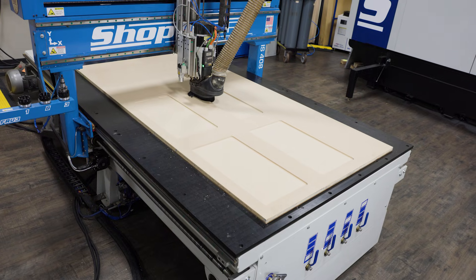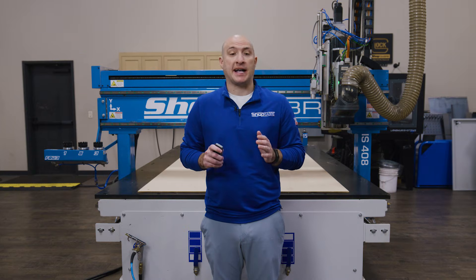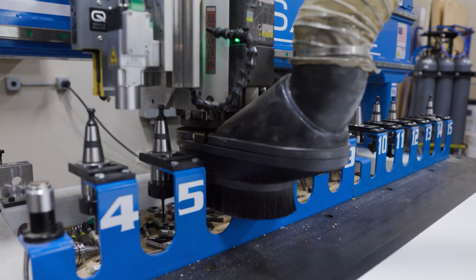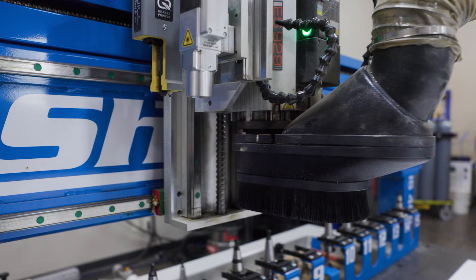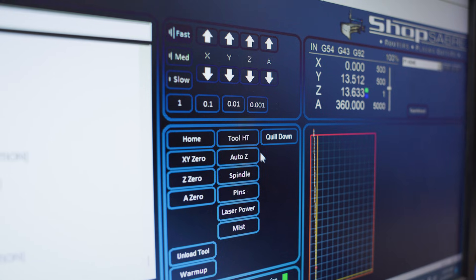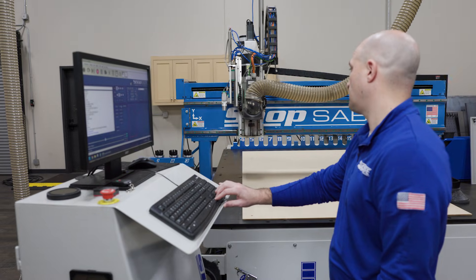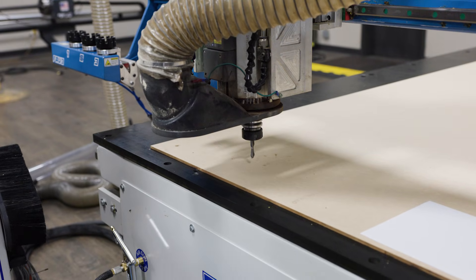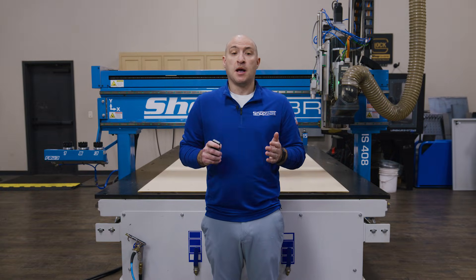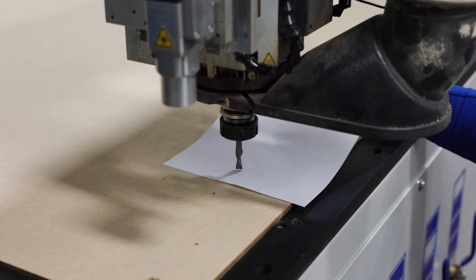Let me show you how we do that. Since MDF shows even the smallest discrepancy in height, we're going to take some extra time to set up our bits to eliminate as much sanding as possible at the end. Our IS series has an automatic tool changer equipped, which will make multi-tool setups a breeze. The machine will do the swap for me, but we'll still need to ensure each tool's Z height is set up correctly. First, I load our straight tool into the machine and hit the tool HT button on the screen so the machine can automatically measure the smaller tool. From here, I jog the tool over to the surface of my spoil board and manually lower the tool until it's just above the surface. I will then use a piece of paper — the typical thickness of a piece of paper is around four thousandths of an inch — but you could use a 1-2-3 block or a feeler gauge for added accuracy. I lower the Z axis down until the tool touches the paper.